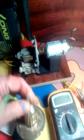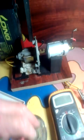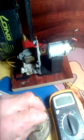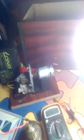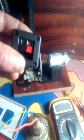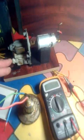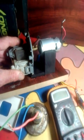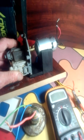There's all sorts of things you could put on the box. Cigarette lighter pieces, and you know, there's the USB parts at the end of the cigarette lighters that could go on that. That could be fed off one of the 12-volt batteries. You could have 2 separate lines for 2 different 12-volt outs. One of these going to 1, and the other one at 24 volts going to 2, just for, I don't know, extra optional power if you needed it. But anyway, the box is sort of getting done, and so I just got to go out now, go and grab a new one of these, stick it all back together. Yeah, it's costing me more than I thought.